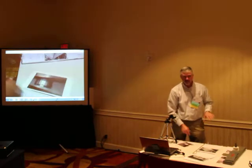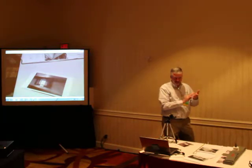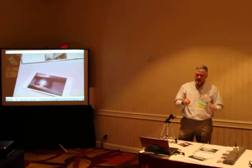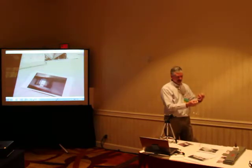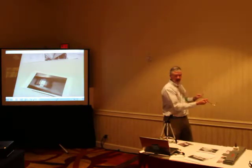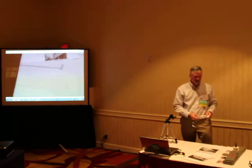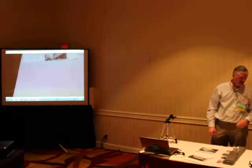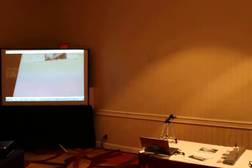this is a little stainless steel rod that mounts onto the window in front of the port. It has enough depth that the curtains can be closed when the port is locked down, and it clears the knobs. So they basically took the rod to a metal fabricator, they flattened the end, put holes in it. They mount it on top and bottom, and sew a pocket into their curtains that can just slide back and forth. Nice way to really dress up the porthole windows. That is the stainless steel curtain rod. Number 10. Okay. Number 11.